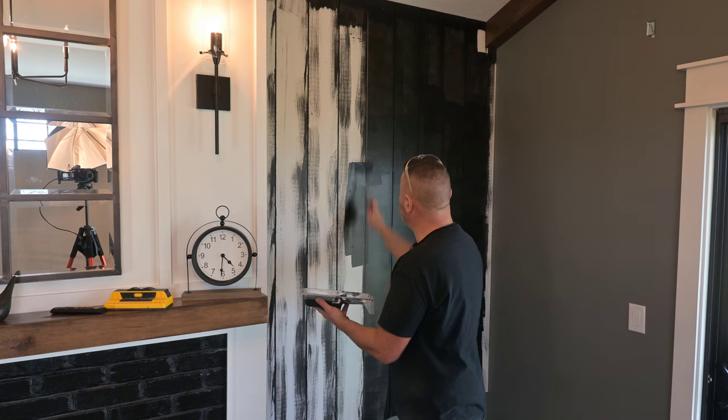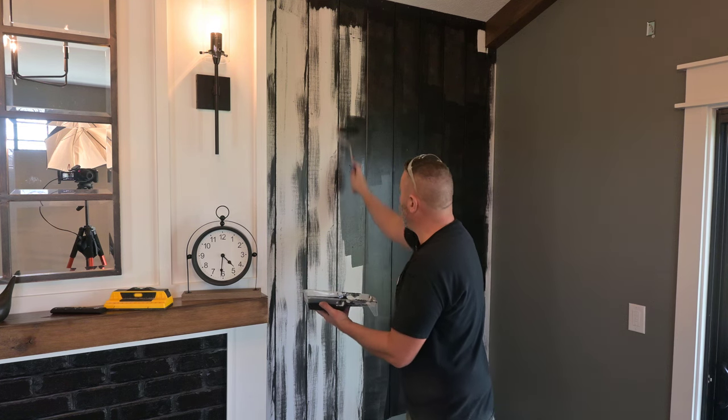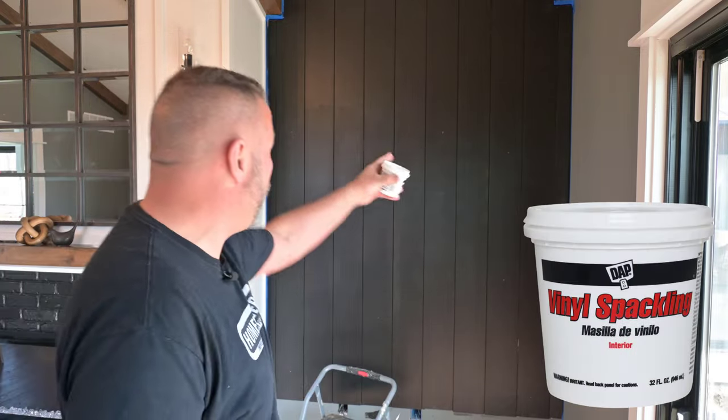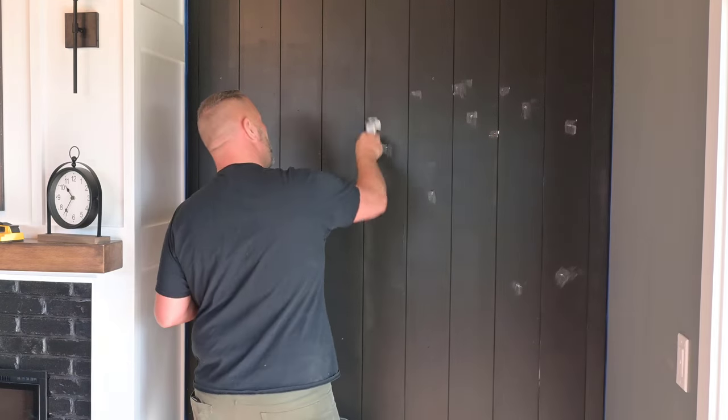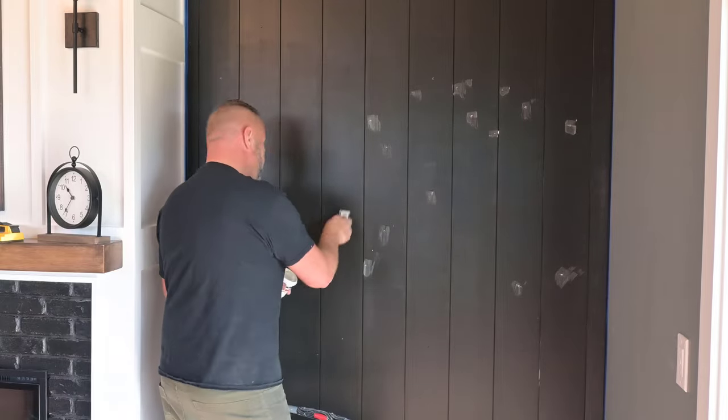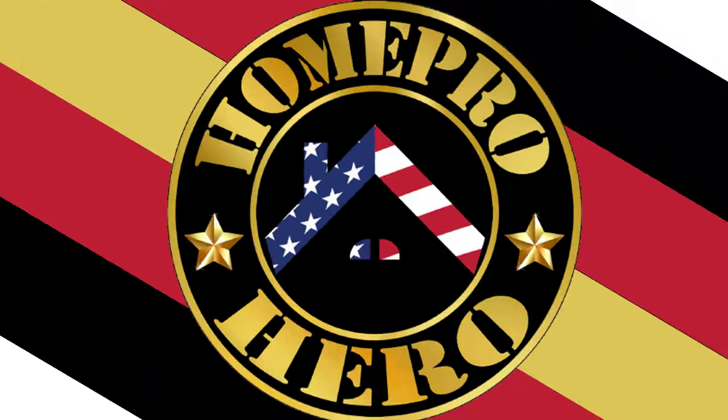I'm just putting a quick coat of paint on it so I can see the nail hole — it's pretty easy to see once everything's black. So it's the next day. I'm going to use this vinyl spackle to hit all the holes. The black paint did the trick; I can see exactly where I need to patch it up. I'll sand it down later. It doesn't look great right now, but we'll make it look good.